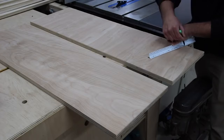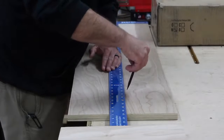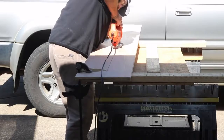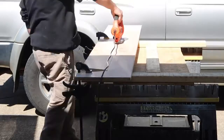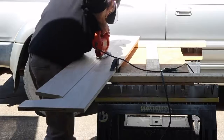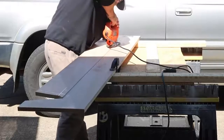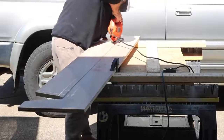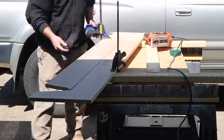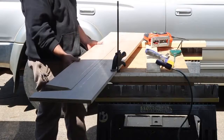I'm going to add some design elements into this bed, making all of it out of plywood. I'm going to be adding in some angled legs and cutting out all of the sides and ends with a jigsaw to give me my leg profile. One thing I learned through this whole process was that I needed to just trust the jigsaw and let it do the work. I tried to rush a couple of cuts and my blade started wandering — you just have to let the blade do the work.